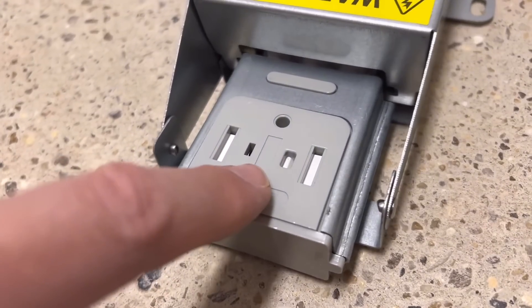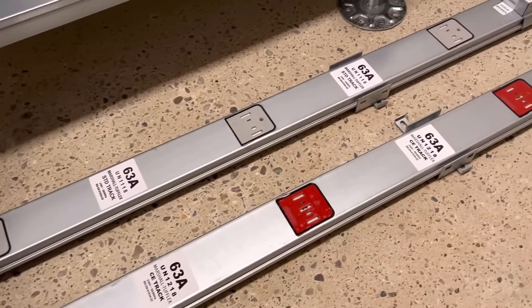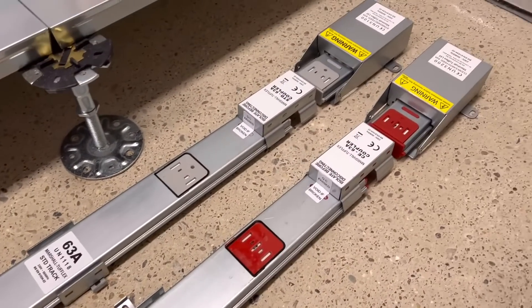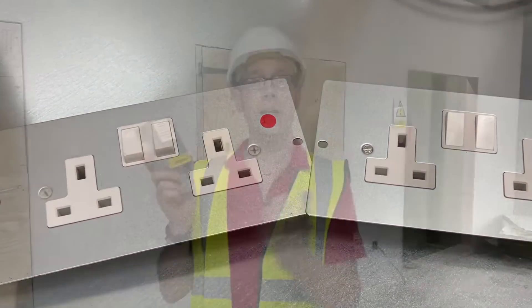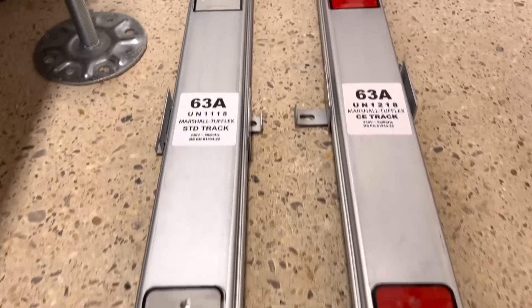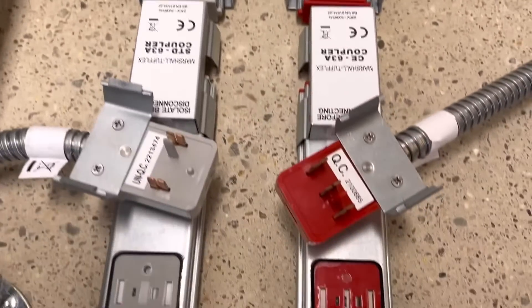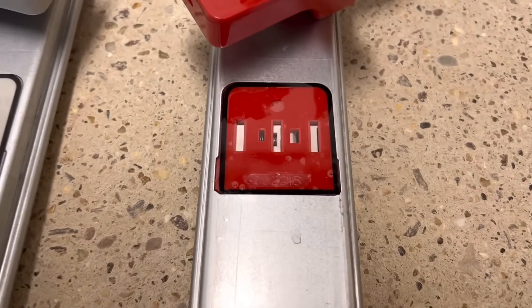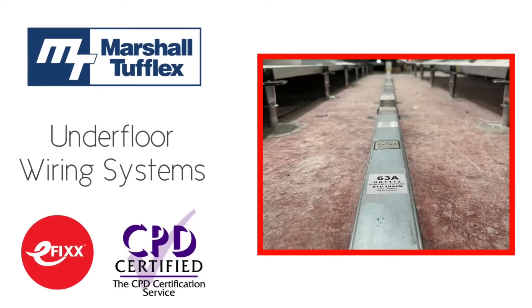You may have noticed inside the feed unit there was a third terminal in the middle that didn't get a mention. This is because there's a variant of the power track system that features a clean earth, easily distinguishable from the regular kit by the red outlets or a red dot on socket outlets. This terminal is intended to receive the clean earth conductor and distribute it onwards. If you look at the two systems side by side, you can see that the clean earth variant has an extra pin and terminal. If you'd like to know just what a clean earth is, check out the free training package.